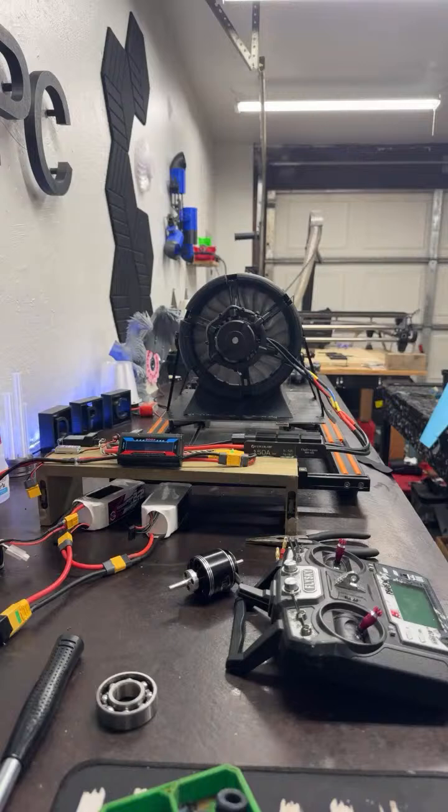Oxygen from the electrolysis, I'm not sure how that works. Oh, well, yeah, you can get oxygen from the electrolysis. It does work that way. It actually comes off the anode, and the cathode is the actual hydrogen, which you can separate both of them through electrolysis if you pipe them out right, and then you can compress them.